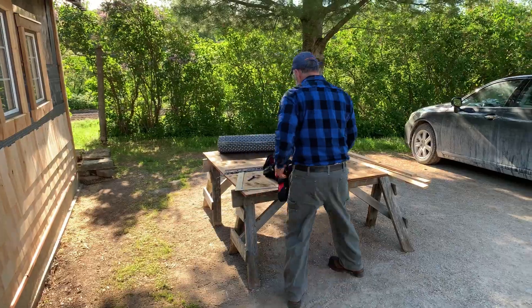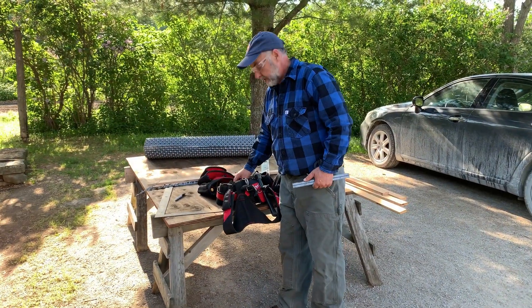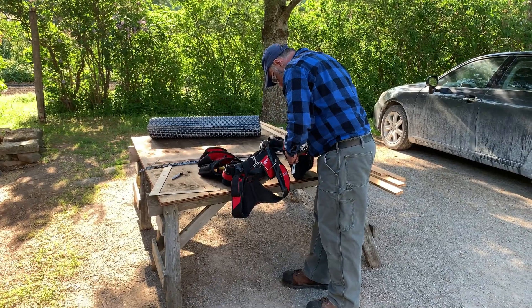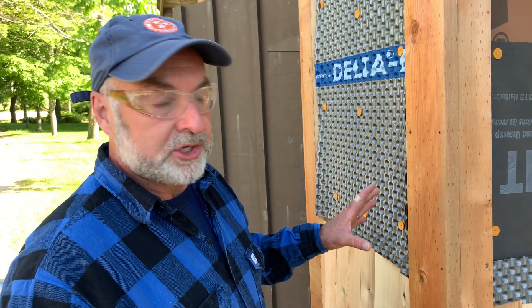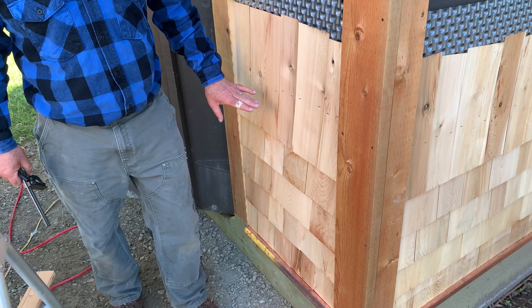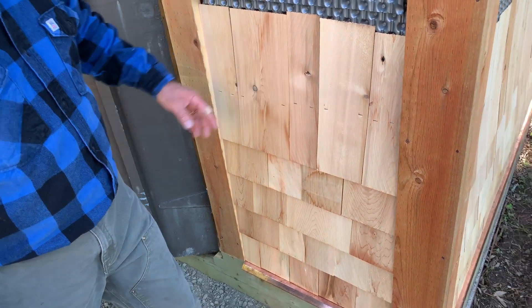The wood would kind of swell shut with such a tiny hole. And even if water did get in — which I don't think is going to happen — it would just drain down from that drainage membrane I created. With this installation I'm aiming for a five-inch exposure. That's how much of the shingle is actually seen. Five inches is what I'm aiming for, so I'm going to make a mark here, five inches up, level it, and fasten that strip on.